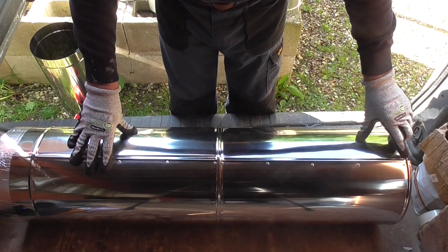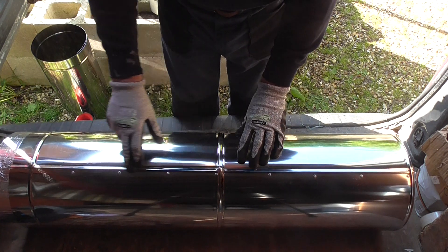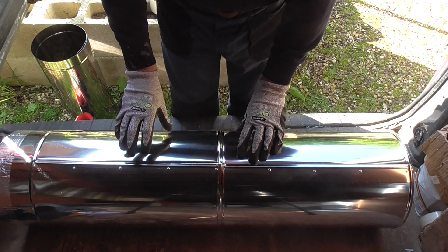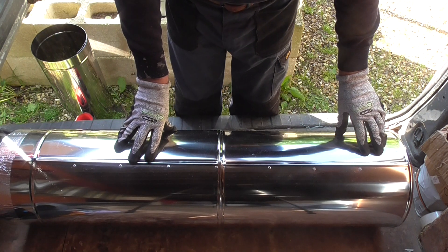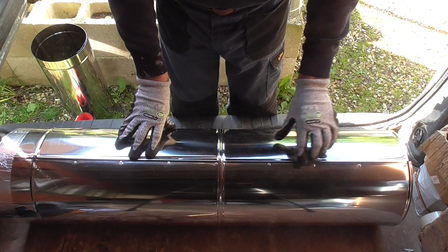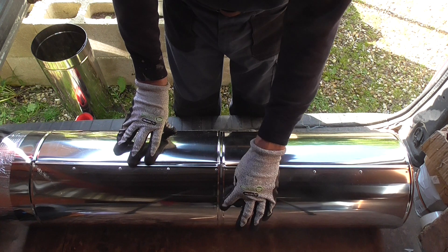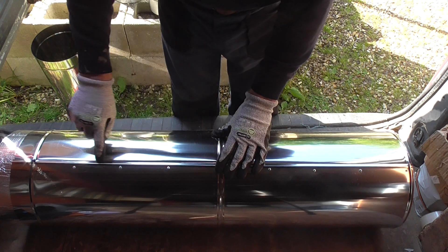We have our rivets at 110mm evenly spaced, so they're all uniform and looking smart. I've put this seam straight — with this one you can have them staggered, which is probably how you would mostly see them, but where this is going it will be in one straight line because that's what the client would like. Under this seam, before it's fastened, a silicone seal will be put in and then riveted to make a watertight seam along here, and the same around the circumference seam — siliconed and then riveted together to make a watertight seal.